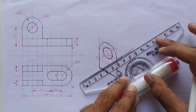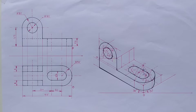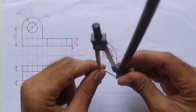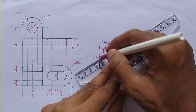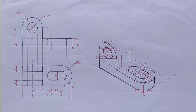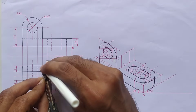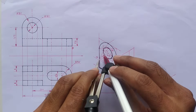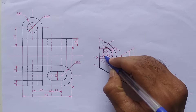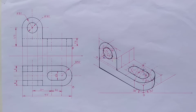Set scale parallel to this line and draw a small line from this point. Again draw a small line from this point also. Now take 8mm distance into the compass and mark a point on this line — this will be our new center point, center one dash.